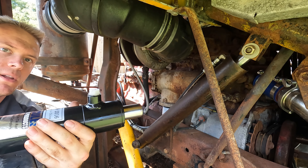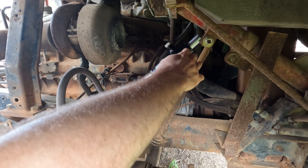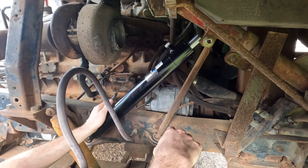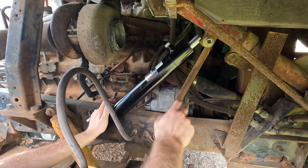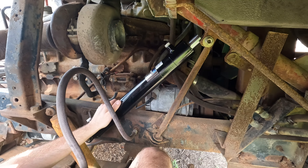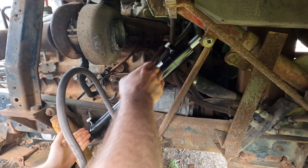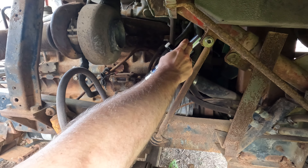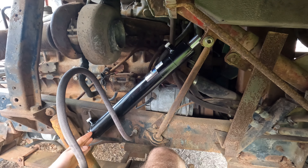Now that I have the cylinder actually in place and on the base pin, you can see where body length becomes a very important factor in this confined space. To get a sixteen inch stroke and still have this size body is basically what I was looking for the whole time, because I knew I could trim this rod down to fit whatever size I need, but I couldn't change my space for the body. Whenever you're looking for your own cylinder, be very aware of the body length — as you go up in the next size of stroke, you'll start to see a massive increase in the length of the body.